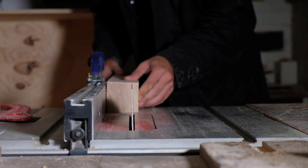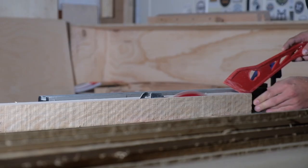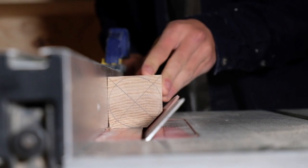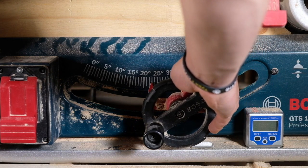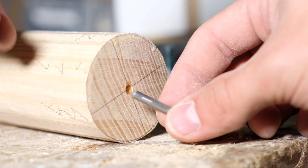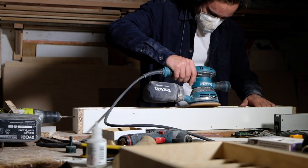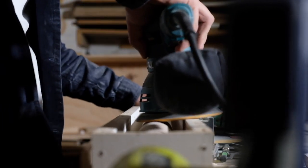To make the stock for the legs, I follow a similar process, using the table saw to machine the ash to its required width and height. However, because I want the legs to be cylindrical, I mark a circle on each end that the table saw can reference — first removing the bulk of the material with the blade set to 45 degrees, before refining it further at 22 and a half. That gets me 90% of the way there, but to make it into a perfect cylinder I knocked up a simple jig. The original intention was to house a router, but on my first attempt I realised it was far too aggressive, so I ended up using the random orbit sander, starting off at a low grit and working my way up.